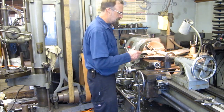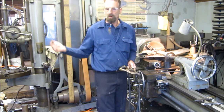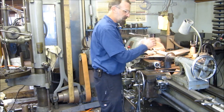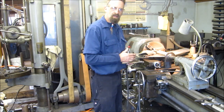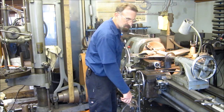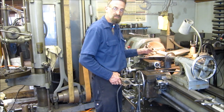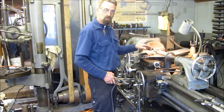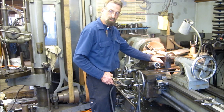together. General rule, whether it be lathe, mill, drill press, whatever you're in, when you're welding on an item in a machine, you want to ground the item that you're welding. Do not just clamp this onto the lathe bed and expect not to have the possibility of damages for wherever that current has to go through to get to the part that you're actually igniting with your welding tool.